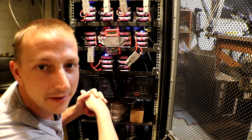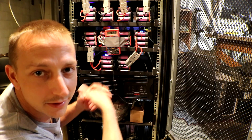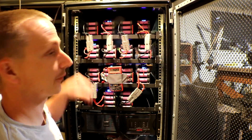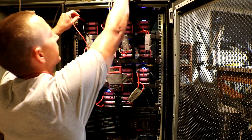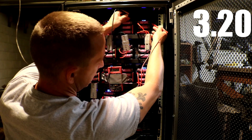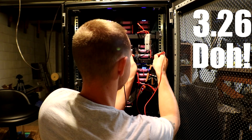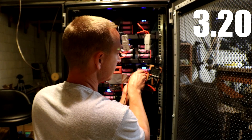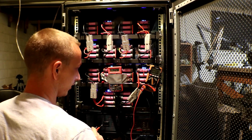This one got down to 2.65V, and that's fine — that's what all this testing is about, to find out where the weak points are and hopefully fix them. I'm going to start at the top and go back and forth to find out all the voltages of the pack. This one right here is the weakest. Readings are: 3.12, 3.22, 3.27, 3.20, 3.08, 2.97, 2.26, 3.26, 3.26, 3.06, 3.25, 3.20, 3.27, and 2.76.